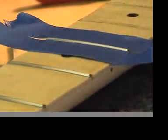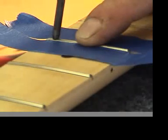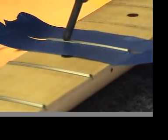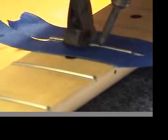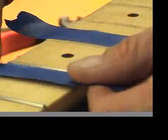So I want to give you a side view here. This is actually a better angle. And you can see I've got the soldering iron there. I'm going to put my finger down here. Again, you're going to feel it get hot. And when it does, slide the soldering iron over, working your way towards the center and the other side. And then I'll grab it here, gently rock it back and forth a little. And you can see it wants to come up. As soon as it gets hot, it really tends to pop right up quick. And just gently walk yourself over to the other side, and boom, out it comes. And then you move on to the next one.